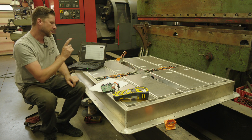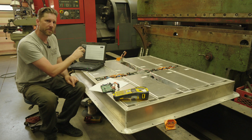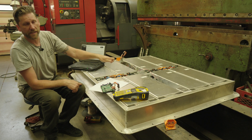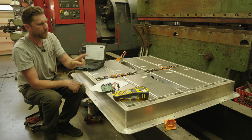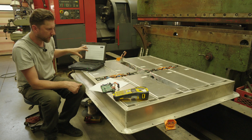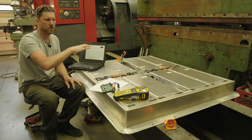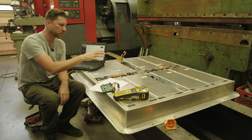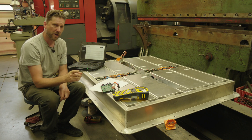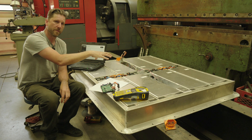The other cool thing this software does is it allows me to run a separate coolant pump based on battery temperature, so I don't need to run the battery cooling circuit through the rest of the car. I can have its own pump running the circulator just for the battery. The software will trigger that pump based on temperatures it sees at the modules — a more targeted approach for cooling the battery alone, which is much more handy when charging, since I don't need to circulate coolant through the entire car.